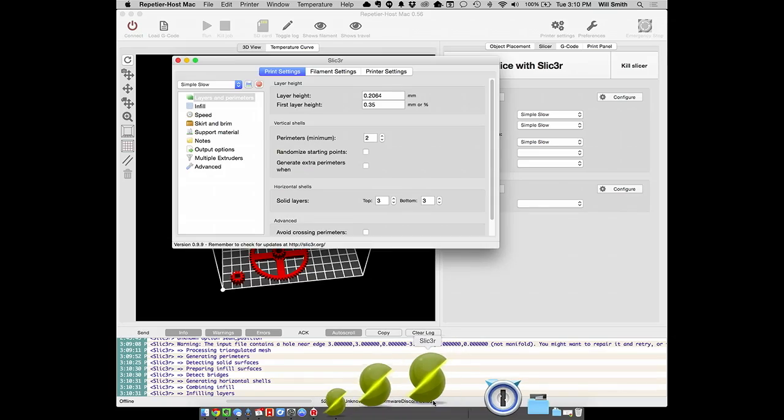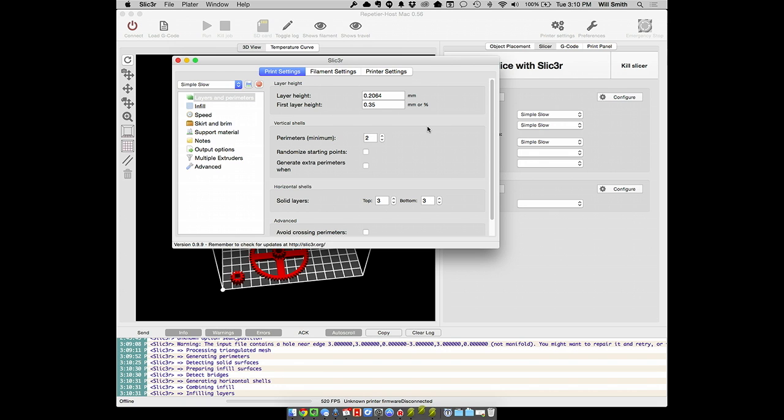Right. So there's a ton, like we can go into G-code here, into Slicer, and I'll show you some of the settings. It looks like I have like 10 Slicer windows open right now. There are 3 main groups of settings for Slicer. One is print settings. The layer height is that vertical resolution we've talked about. The first layer height you usually do a little bit thicker just to improve adhesion and to help cut down on the warping. But then you also control things like perimeters.